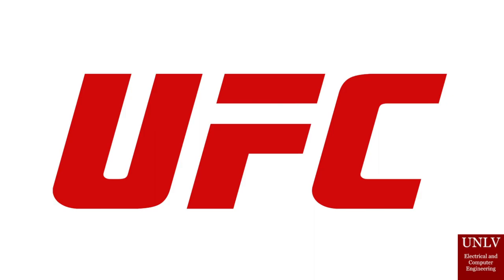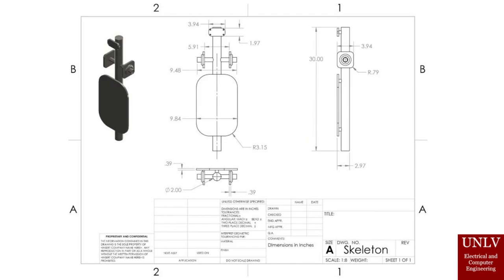This provides the context for this project created in collaboration with the UFC — a grappling dummy that provides sensor readings of the force applied to it, in order for the user to monitor their performance over time. With the help of mechanical engineers, we were able to create a skeleton that can house the necessary hardware. The UFC Smart Grappling Dummy is able to measure the torque applied when performing an arm bar and the pressure in a choke, and display this information to the user via an app and Bluetooth.